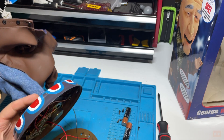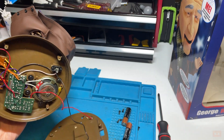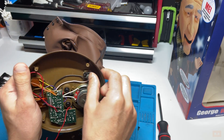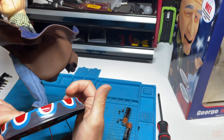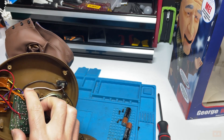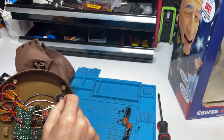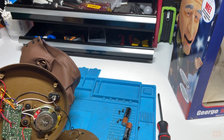Taking the base off, this is obviously the wiring coming out. There's a little bit of corrosion on the connections which I'll be tidying up. His feet are there and the wires are going straight up - corrosion on the DC connections too, but we know we're getting enough power because the speaker is working. Sometimes before you start breaking everything down it could just be a wire that feeds a motor that's become damaged.